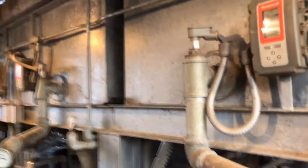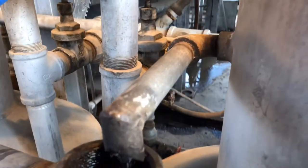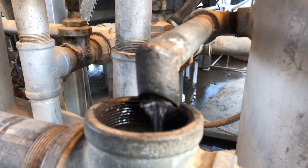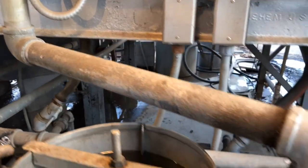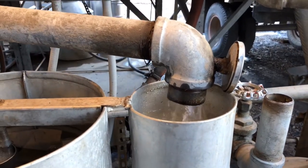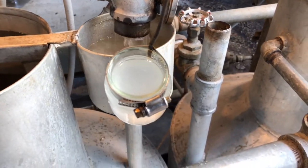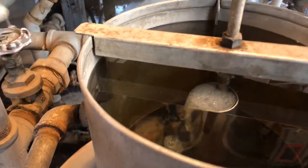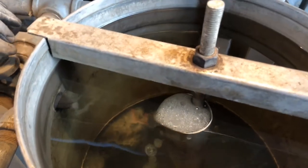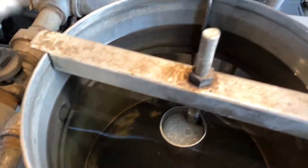She's raising the water level in the bottom of this, and that oil is going to start coming out — you'll be able to see it right here. That's straight, 100% pure mint oil. This is that mixture of water and oil right here. You can see the oil sitting on the surface — that little bit of oil floats to the top. What we're looking at on top is pure oil. You can see what we call the mother clear down inside there — that's the water level down below, and all pure mint oil up here on top.